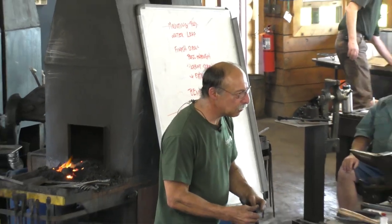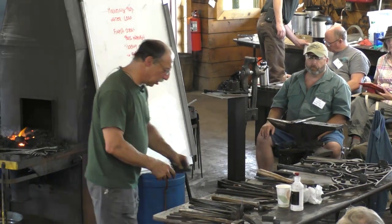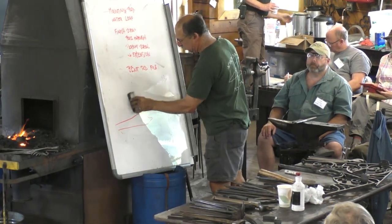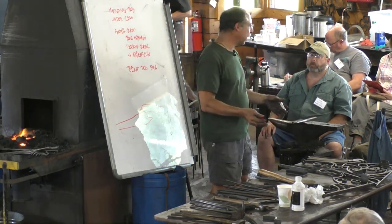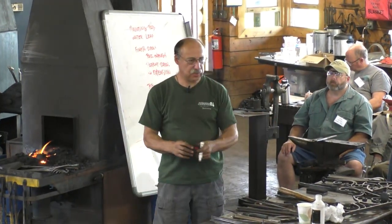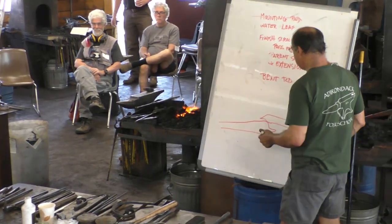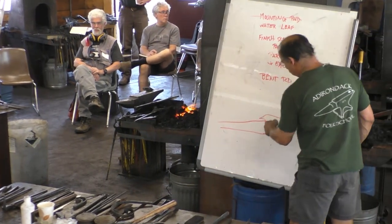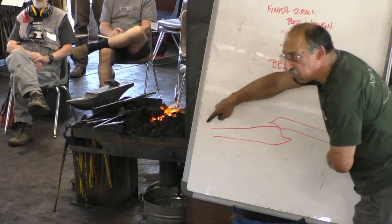Do you always upset just one end, or do you upset both ends at times? This is another of my late in life insights: what is the purpose of upsetting? You guys all know, when you weld, you have to upset, right? Why? So you don't forge it down too far and go too thin. And so where are you likely to get it too thin by forging it down?